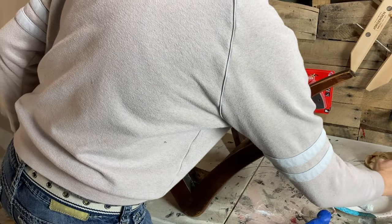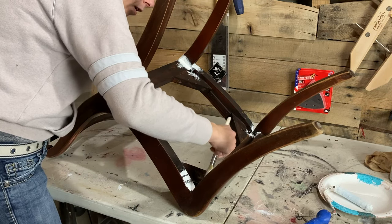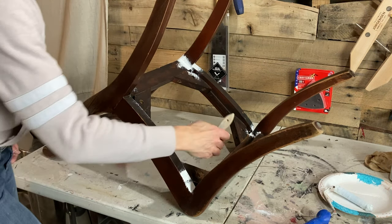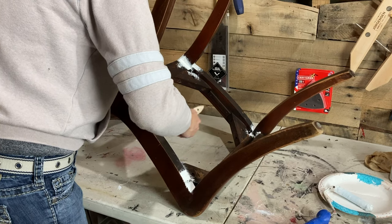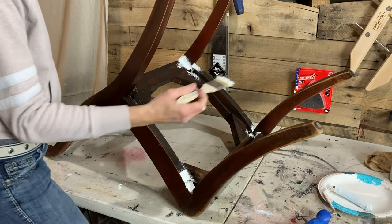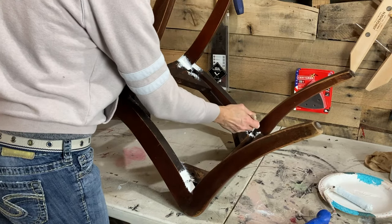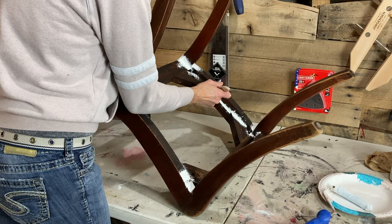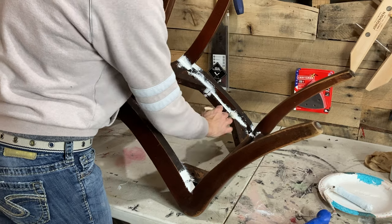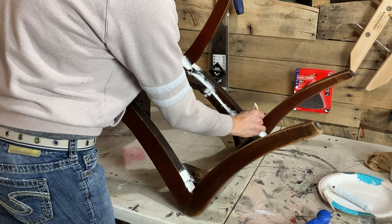This is what I discovered is the closest to a spray texture. This technique comes out the closest to what I already started doing by spraying them. So I just get a cheap chip brush and dab it into the Boss primer. And I'm getting into the corners by tapping instead of brushing it in. So you get all of the corners and joints like this,